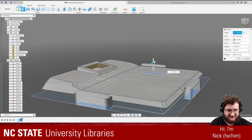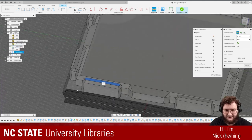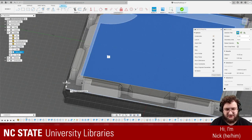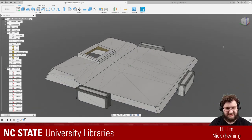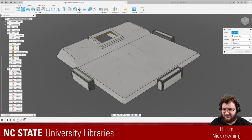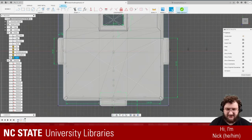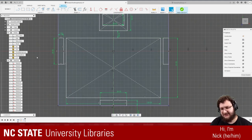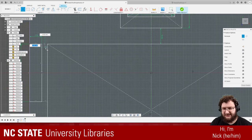I'm going to do this with primitives. I'm going to take these little pegs and bring them up to the right height. I want to check how tall they really should be — they should measure roughly 12.5 tall. I believe this face is 10 millimeters off the surface, let me double check — yes it's 10. So these should measure 12.5, which looks like it's pretty much spot on. Then we want this face to measure 10, but I need to add a little more detail to this sketch.